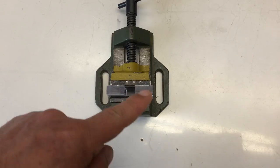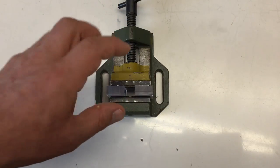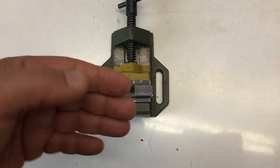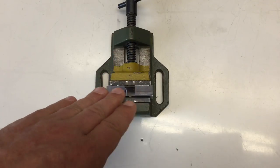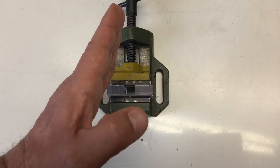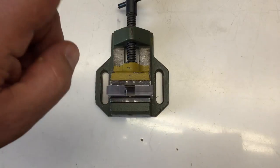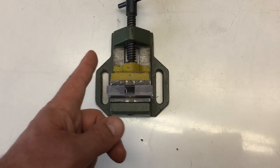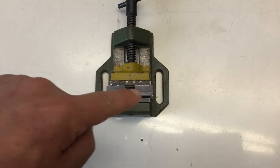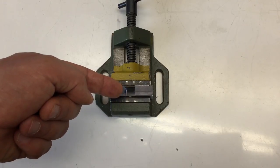Now I have two identical blocks, almost to the size I wanted. Actually, in each dimension I cut half a millimeter too large, and I guess that's a systematic error in my table saw. I was pretty sure I adjusted it to the tenth of a millimeter, but given how that thing is built, the blade got a little bit of flex. So for this material and that blade, I have to subtract half a millimeter in the future from my measurements, or how I adjust the saw. Anyway, let's put four holes in here and cut some threads.